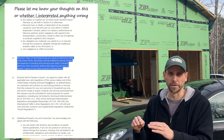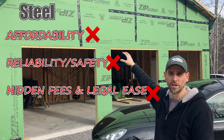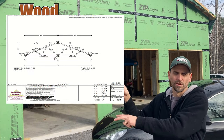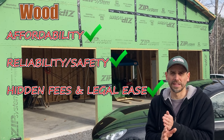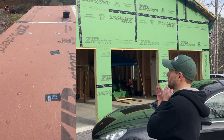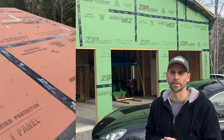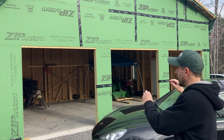That was the turning point. The next day I headed to the local lumber store, sat down with them, gave them the parameters and location of my building, and they sent it to the truss company. Here's a picture of my trusses — I used Rustic Truss in Northern Maine. They gave me a lead time of almost eight weeks, which would have put me around Thanksgiving for the structure. But they actually delivered four weeks early, giving me enough time to get the trusses up, installed, and roofed before the snow came. I was really happy with their performance.